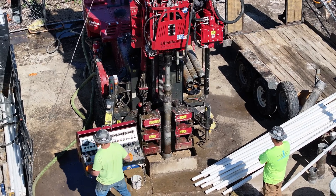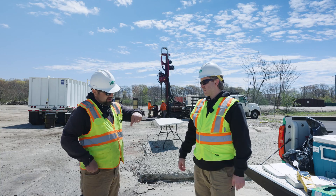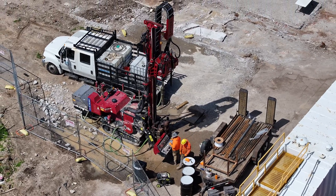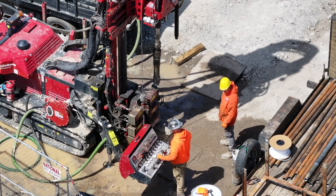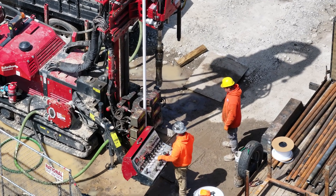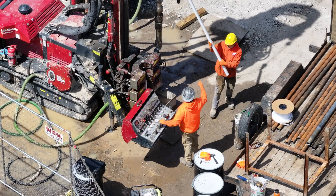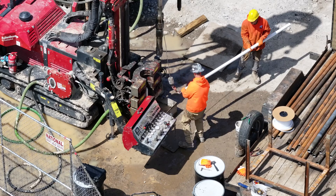Okay, and what does the sleeve look like when it comes up? What's that soil like? So the sampler goes down — the five inch rods advance to a depth and the sampler, the three inch rod, goes beyond that into fresh dirt. It's a ten foot length, and all that soil from that ten foot length gets captured in there, plugged up just from pressure, brought back to the surface, and then extruded out — and that's how we sample it.